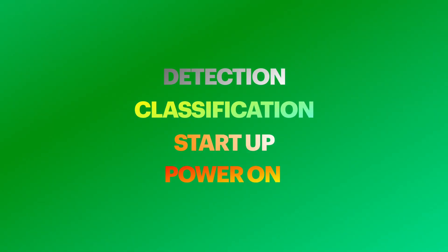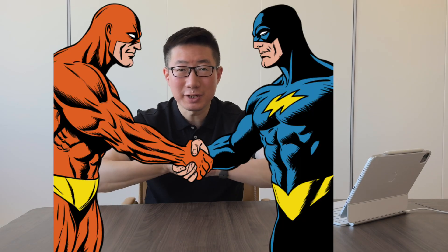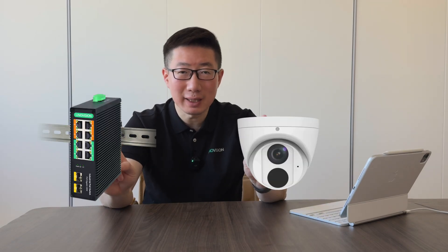Let's start with the key steps to get the overall picture. PoE — Power over Ethernet — follows IEEE 802.3af and 802.3bt standards and powers up devices through a four-step negotiation process. It's like a handshake between the PSE and the PD. Step one is all about detecting whether the connected device is a PD.